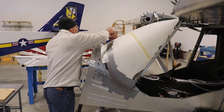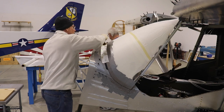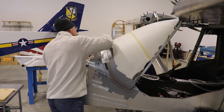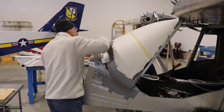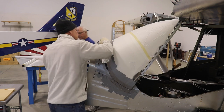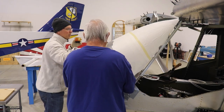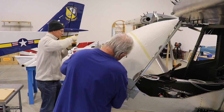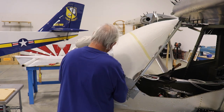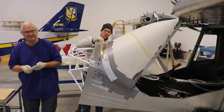Now I'm going back with the cup of resin — this is where you have to hurry a little bit because when that resin is in the cup you only have a certain amount of time before it starts to harden. Len put down the fiberglass on top of the thin resin layer, and now I'm using a paintbrush to put down a thicker layer of resin on top of the glass. This thicker resin layer will soak into the first layer and be thick enough so that when we lay the second cloth on top, it soaks up through and bonds the two layers of glass together.